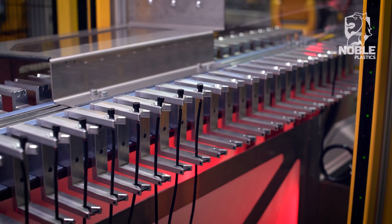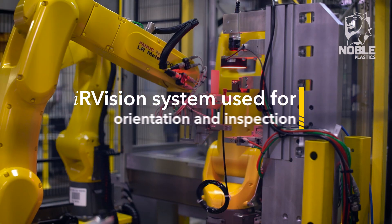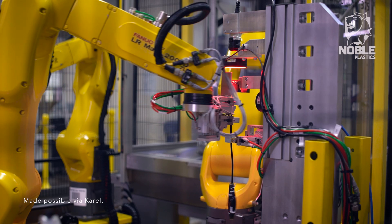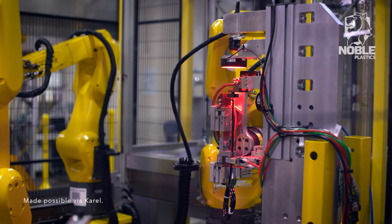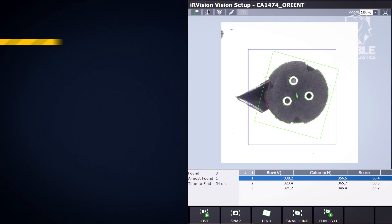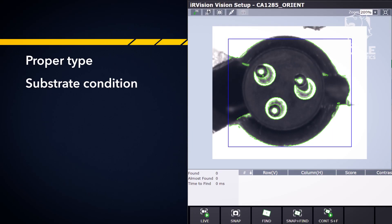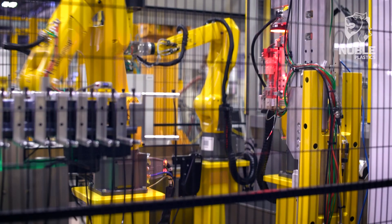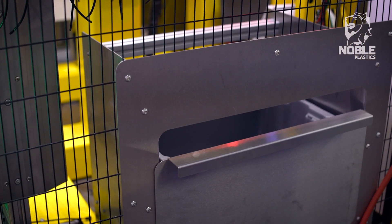The system accommodates gaps in the loading. Once a part is picked from the carousel, it is placed on an incoming inspection fixture for orientation and inspection. Orientation within a specified angular window and straightening of the wire is in preparation for pickup by robot two. All substrates are inspected for proper type, substrate condition, connector location, and correct wire connections. Parts not conforming to specification are discarded in the adjacent reject bin.